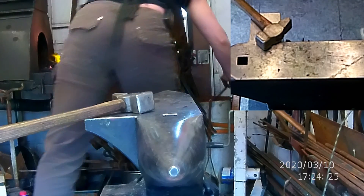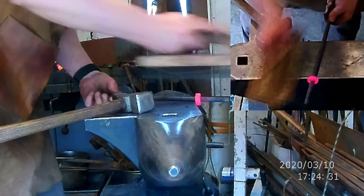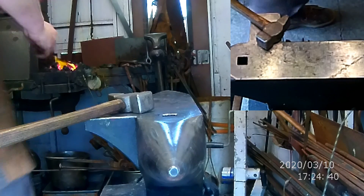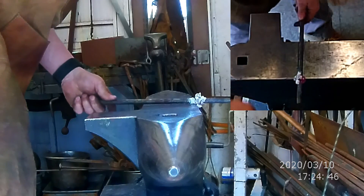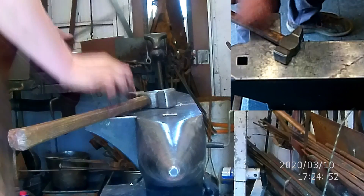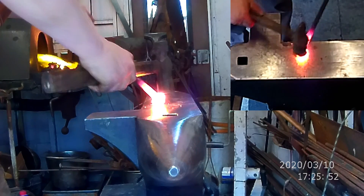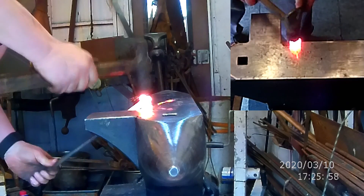Get that chamfer gone — I'm going to cool that section off. Coming back, we're going to clean up that section we just welded. We're going to take one more weld on it, move that back down to the end, or nearly so. Take another fast welding heat. Now we're going to put some bevels in it and make it look really pretty.